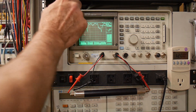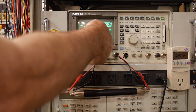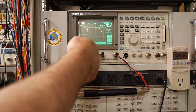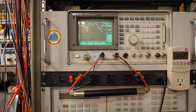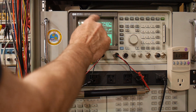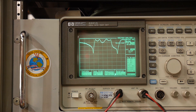Okay, this is an HP 8921 — I think I said 8920, they're very similar instruments. This is an 8921A, and we're using it as a spectrum analyzer with a tracking generator. That's another way to make the measurement. It's going to be outputting frequencies and coming back around into the spectrum analyzer, performing the exact same measurement. And you can see that the shape is exactly the same as the nanoVNA. There may be some differences in accuracy and dynamic range between the two systems, but they give very similar results. We're centered on 90, span of 50, and we're getting the triple dips. Looks very similar.